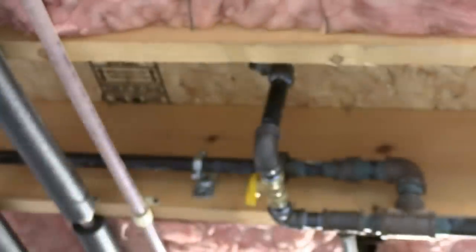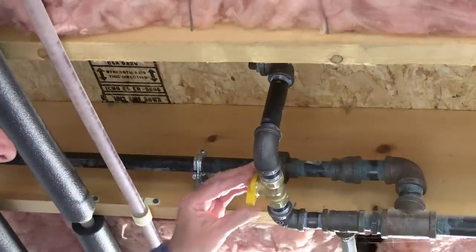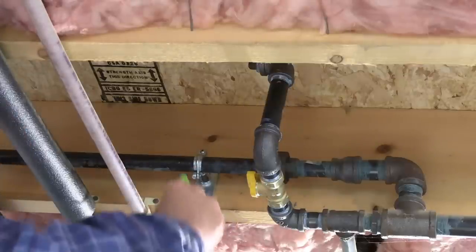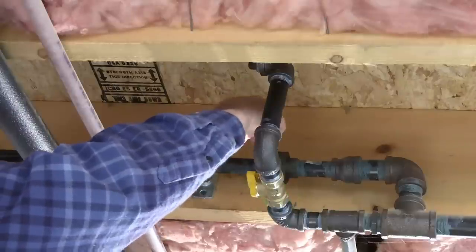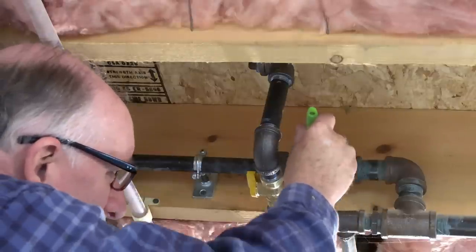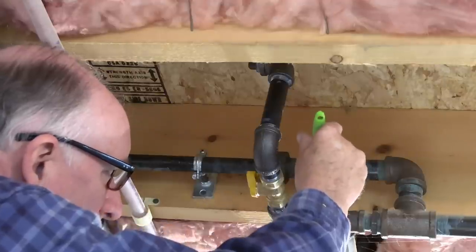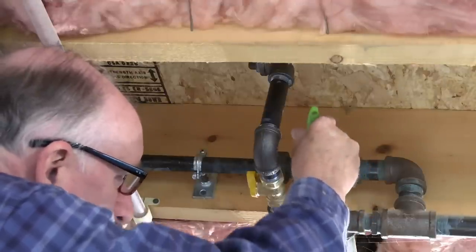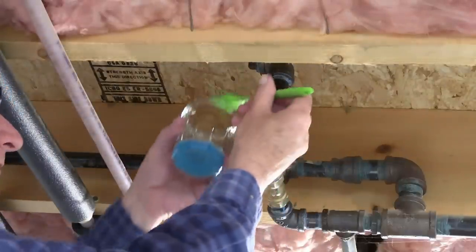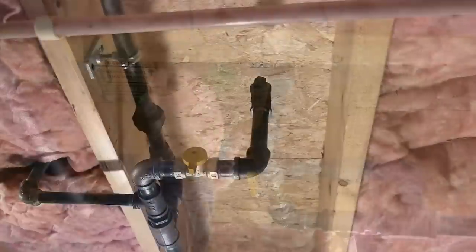The system is now pressurized. I'm going to quickly open this and liberally paint it on every surface, let it run right around every joint starting from the first one. Detergent can be a little bit corrosive, so when you get all done make sure you wash it off thoroughly. So far I'm seeing no bubbles — the smallest bubble is not permissible. That's a gas leak, and eventually with a leak it'll erode and get larger over time.